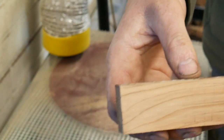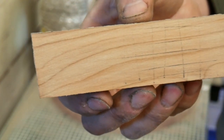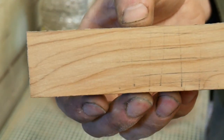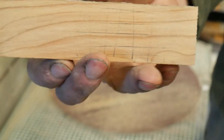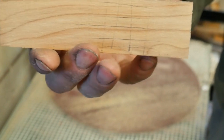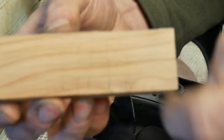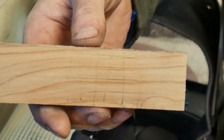I must say that before I've gone onto the flat table here, I've been on the platen with my grinder with a new belt and that gets it quite flat. But you can see there's a slight bow in the wood — it's taken off the edges but the bit in the middle just there needs a bit more work. Not much, it's quite fresh grit on that so it takes it down quite quickly.